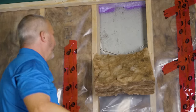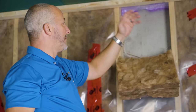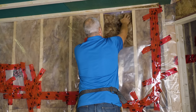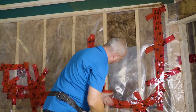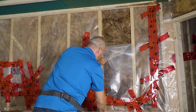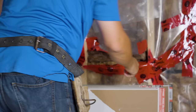You'll see they've got this purple foam around the exterior wall. When they built this house, before doing the insulation and the rim joist, they did a thin layer of spray foam around the entire rim joist to create a perfect air seal. But this insulation had slumped — it needs to be lifted back up into position. You've got to love an electrician because they do a great job meeting electrical code, but when they're fussing around with your vapor barrier and insulation, make sure you follow up that everything is still closed up properly. That one little dark space behind the plastic is going to end up destroying all the work in this room.